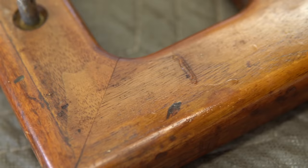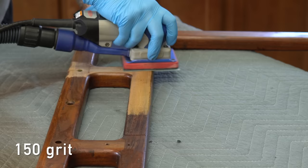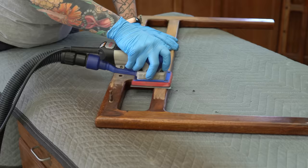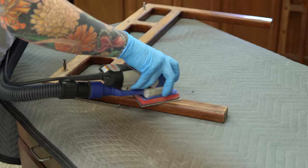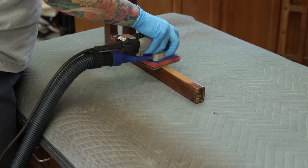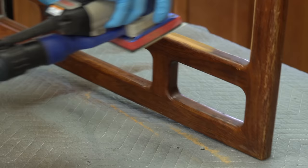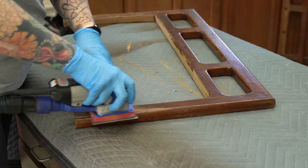Restore Finish works great on pieces that have a little bit of surface damage, but as soon as you have scratches and gouges and chips that are down to the raw wood, that's not a candidate for Restore Finish. That's either spot repairs or full refinish. And I've seen the effects of using, I don't want to pick specifically on Restore Finish, there are other products like that, where people will just throw some oil on something because it temporarily makes it look good, just like I just did there. But when the finish is not intact and there's damage, it can actually make refinishing harder down the road. So using these products, you just have to know what you're working with, and it shouldn't be your go-to. It should be reserved for specific situations.